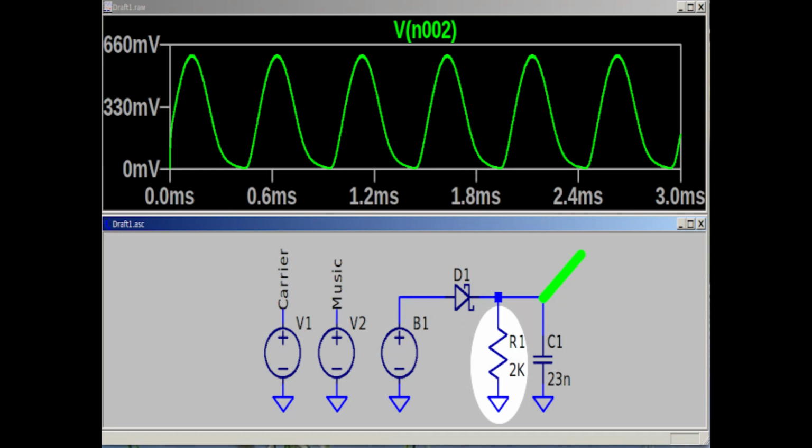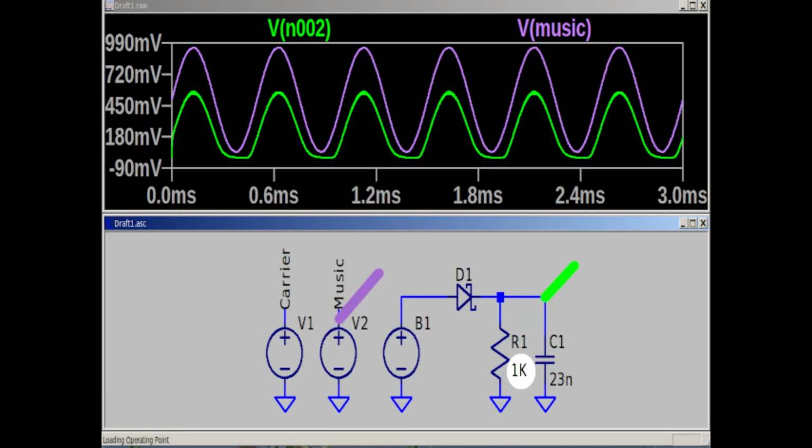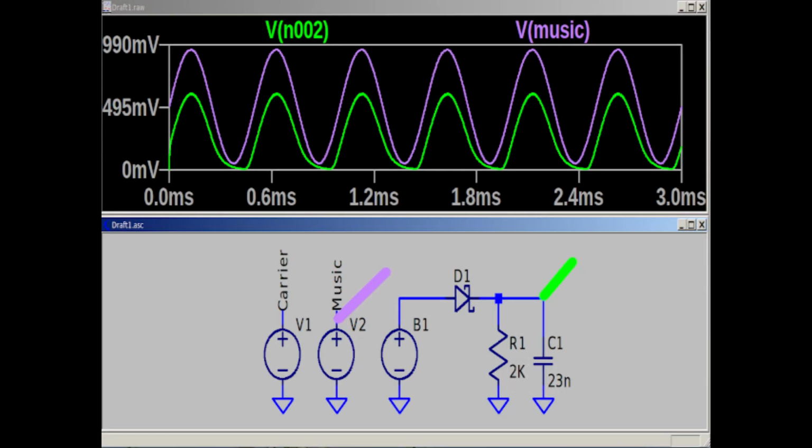On my crystal radio, this sounded to me just like what I heard with the 1N34 diode in place. Making it a 5K resistor made it slightly louder, but it was definitely more distorted. Reducing it to 1K made it decidedly quieter, but also more distorted. The ideal resistor to use is going to naturally vary with the kind of crystal radio you build and also the sort of earphone you are using. Mine has a quite long twisted cable on it, which I think is making its capacitance higher than many others would have.